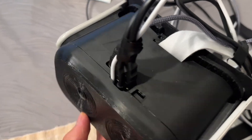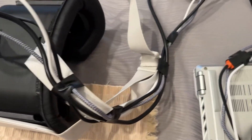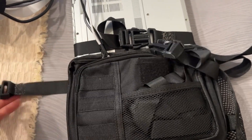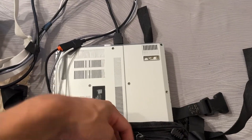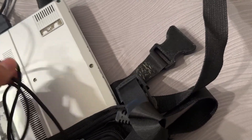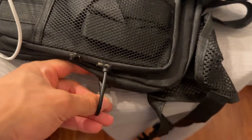In this video I'm also showing the full setup. All the wires plug into the top of the headset and can be removed, so none are stuck inside. I have black electrical tape securing the wires to the top strap, which travels along the back of my neck and splits into two portions. One is the HDMI cord, which plugs into the top of the laptop next to the charging port. There are two 3D printed buckles — the top one holds my laptop against my back, and the bottom one secures the bag shut. In the mesh pouch at the front there's extra strap I kept for later use. The three USB cables go inside the second pouch, where they connect to a USB hub, and the pouch is convenient for storing the extra wire length.